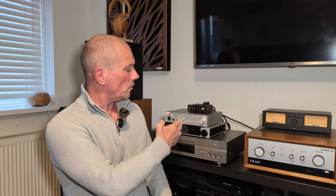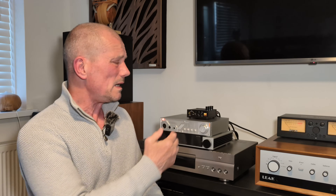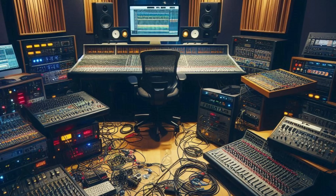If you're running your amp five or ten meters away from the preamp, then yes, I would consider using XLRs or balanced inputs. However, over short runs, it's not going to make much difference in sound quality apart from being a little bit louder. So don't get too hung up on having balanced inputs, especially if your cable length is about a meter long. It's not as if you're a sound engineer working with tons of electrical equipment and long cable runs. If you are getting some interference, maybe consider getting a better RCA cable.